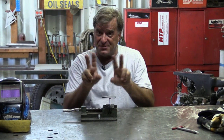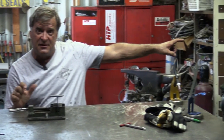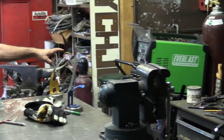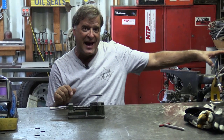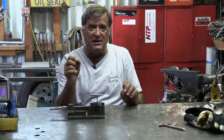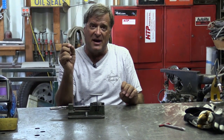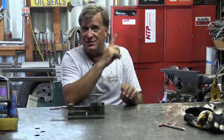Your tungsten will touch that metal for just a second and your arc will start, then you can just go to work. As far as differences in the machine between lift start, high frequency, or a machine that has both capabilities — like this one, the Everlast Power TIG 255 EXT. This one's actually kind of special because it has an all-electronic high frequency component in there. There are no points. On some of the cheaper machines, you'll hear people talk about having to adjust the high frequency points. This machine does not have that, so there's nothing to wear out in there.